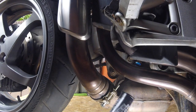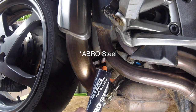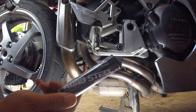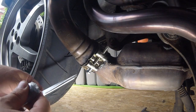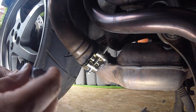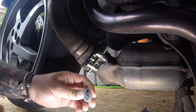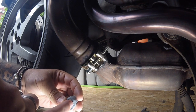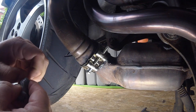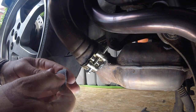So what we're going to do is use this Abro Steel. What it is, it's like a two-part putty - I think it's an epoxy putty - and you mix the two together like a putty and then you can fill all the holes and it sets hard. Reading the instructions, this stuff starts to go off in two minutes. You can see there's a different colour - the inside dark bit - you mix that with the outer part and that's what creates the chemical reaction. I think it only takes about an hour to be fully hardened.